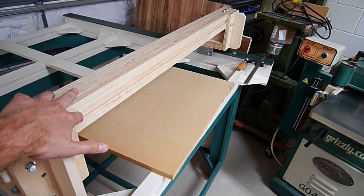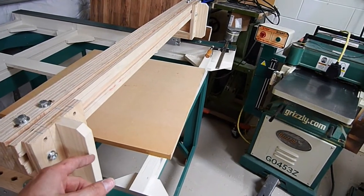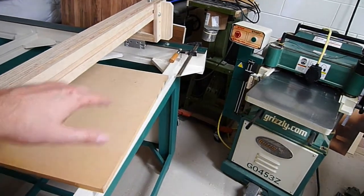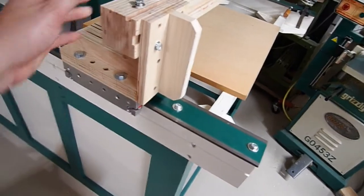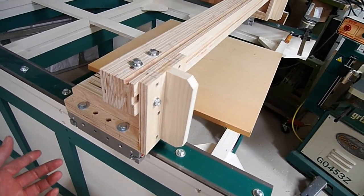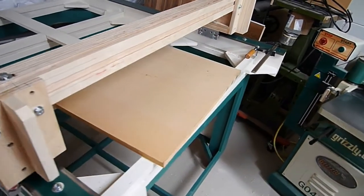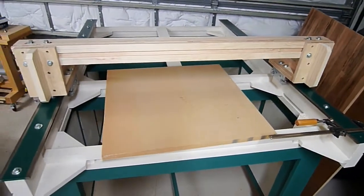What I'm going to do is extend it out far enough to tie into these two bars and run another brace on this side — screw it in all the way down — to make it harder to flex. It's probably a non-issue once the gear is locked into the track and the motors are on, since it would have to be skipping teeth to flex that much, and there's gear track on both sides. But I'm going to fix it structurally and not rely on the mechanics to hold it in place.